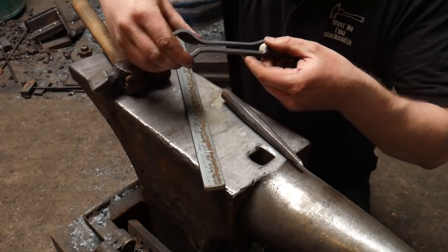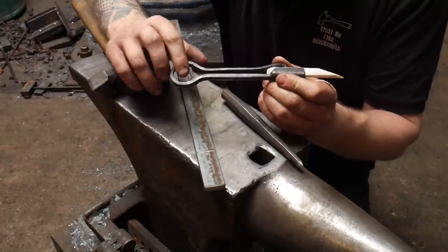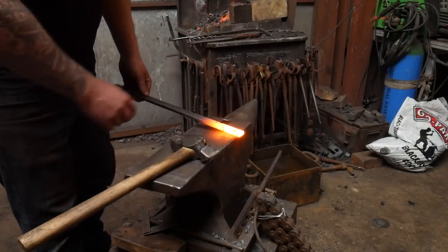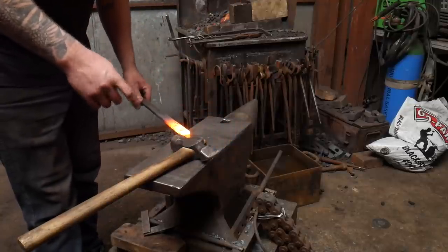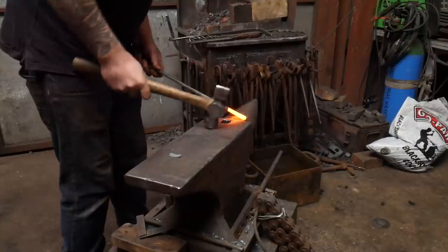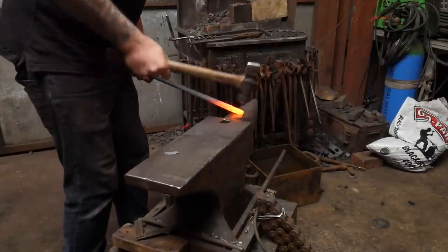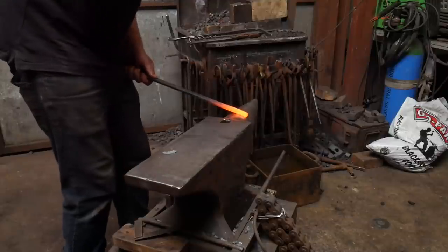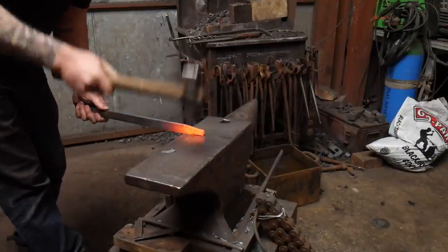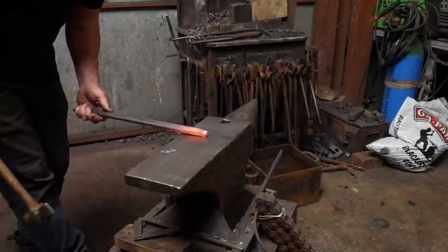These centre-dot marks are going to be the indicators for where I need to neck down the material to make the little arm. As you can see, this arm is quite long so there's a lot of drawing out to do - if you've already practiced drawing out on your tooling, that's good. We're basically going for almost exactly the same design. I picked this task because drawing out or forging is a very difficult process for people to get to grips with. I want to walk up to my marks and start by drawing the end down and getting rid of some material, then come up onto the anvil face and work a little bit on one side, then turn it over to the opposite side.